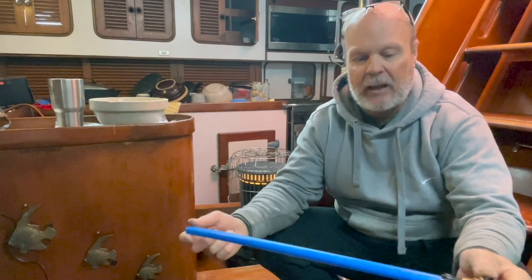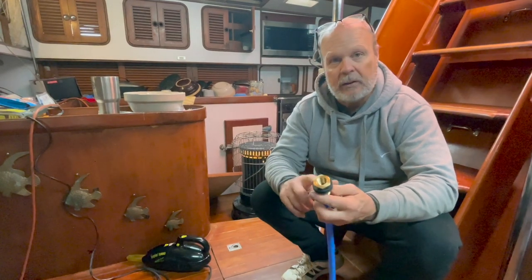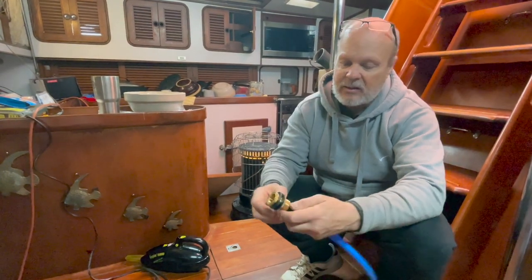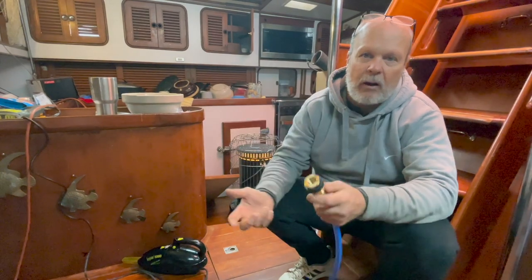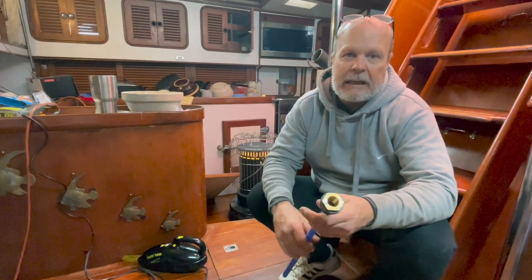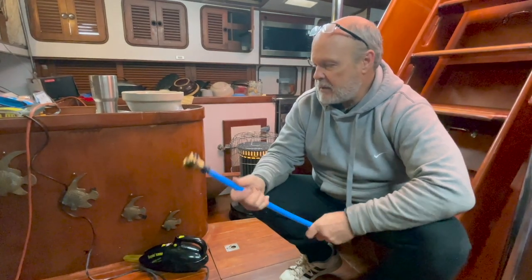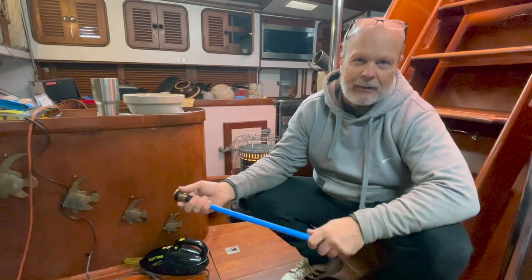It's all plastic — no more copper. Because everything on a boat, the more plastic the better. You get electrolysis on everything around here. When I took apart the old one and pulled it out, this thing here just twisted right off — it was no good, it got eaten away. That was 40 years in the boat, but this plastic will outlast me — I guarantee it.